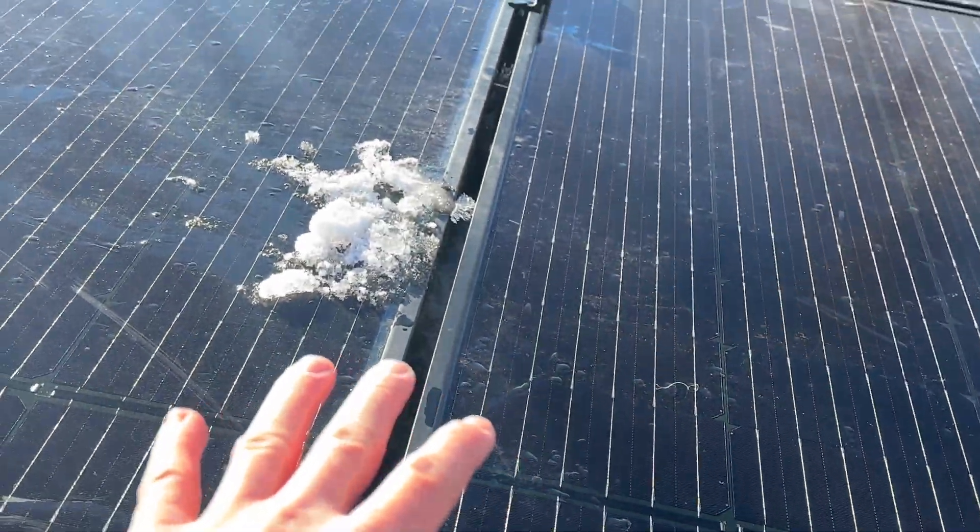The solar panels themselves are rated for a certain snow load — you're not supposed to put too much weight on the attachments. These guards are going to keep snow on top, so you could potentially have some weight issues. It might be smart to contact the manufacturer of your attachments and maybe the solar panels themselves. I recently did a service call at the Sundance ski resort where an entire eight-pack of solar panels was ripped off the roof — the weight of the snow built up so high the whole system gave way. That's an extreme example, but there are things to consider for functionality and safety.